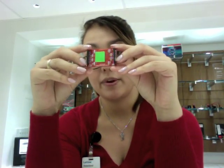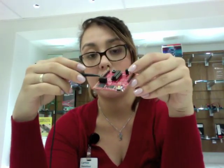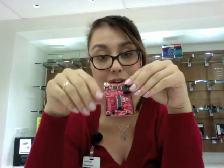Male headers were selected because, at the time, we only had one booster pack out on the market, and that booster pack required female headers on it and required male headers to be soldered on the board. Some feedback from our channel partners was that you could use existing logic analyzers and probes a lot easier on male pins than you could on female pins.